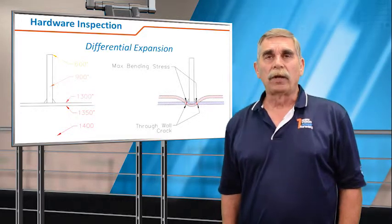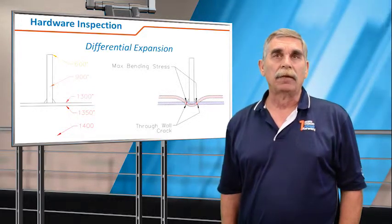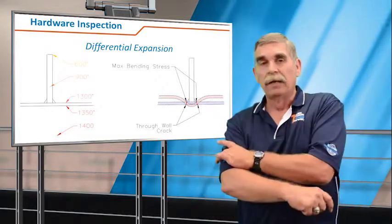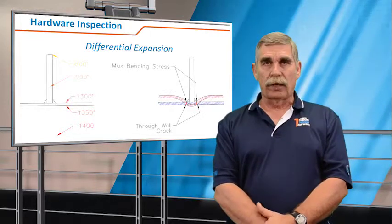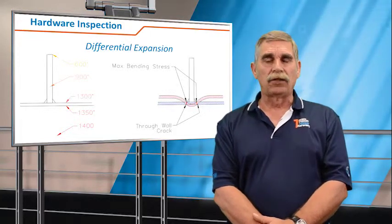As a result, it was almost like putting a tourniquet on your hot pipe — it will squeeze the pipe and prevent it from growing radially. This will cause extremely high bending stresses at the toe of the fillet weld attaching the ring.